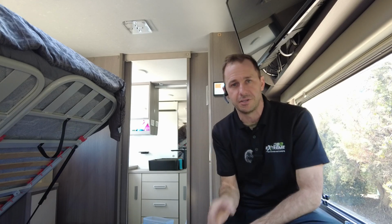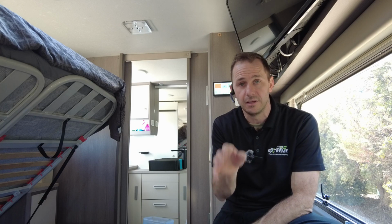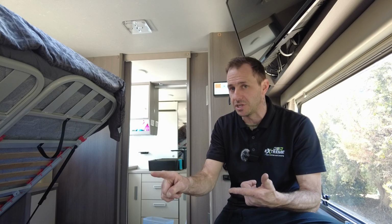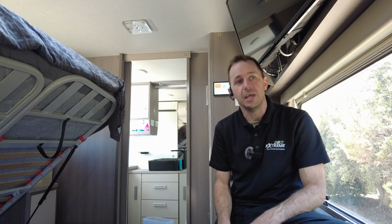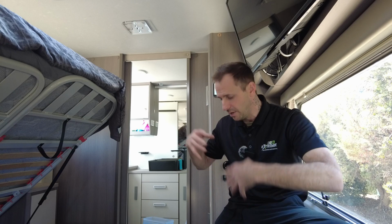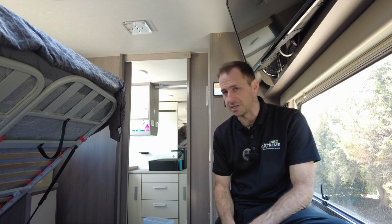So over the BM Pro system, as you guys are aware, it remains here. You've seen the video, you've seen the photos. It is downstairs, and I'll show it to you. It remains there. It is unplugged. It is no longer used as a mains charger. The auxiliary in is disabled and completely gone, and the solar input that goes into it is completely disabled. It is now a master switch controlled fuse box, and that's all it is. Nothing else. It would take a lot of time to rewire it, as messy as it is.